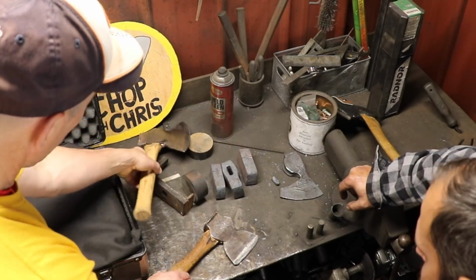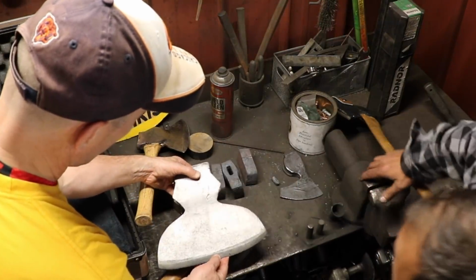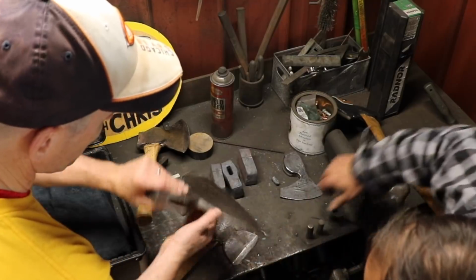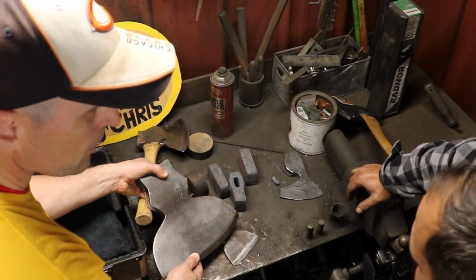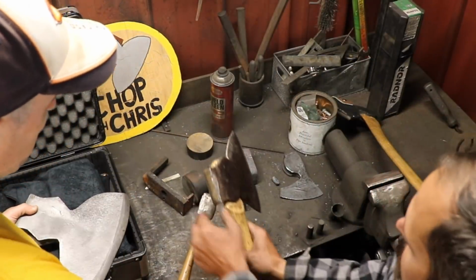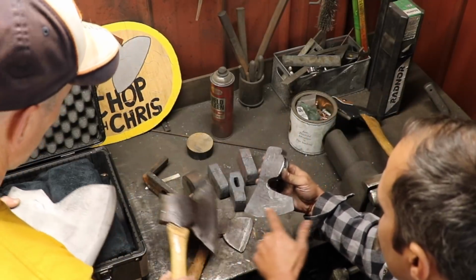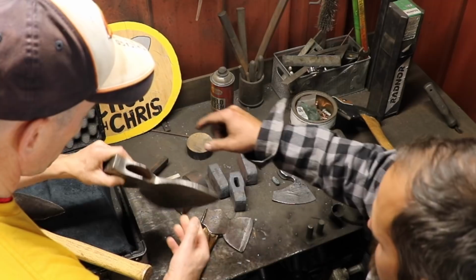Awesome. And the other thing I brought is this broad axe, which I just picked up in perfect condition. Giant. It's awesome. It's razor sharp. I don't know if it's ever been used, but you can see here where they folded in the forge-welded, high carbon bit. This steel is all one steel. That high carbon bit's great, but with these you get mushrooming. You're striking that back end, and it mushrooms more. This could mushroom a little bit, because when you heat treat it you're going to harden that edge more than the back, but it's going to take the abuse a lot better than that.